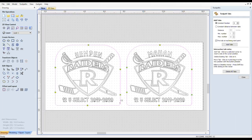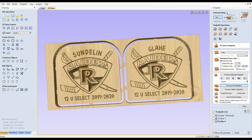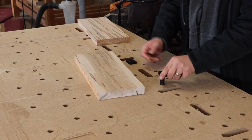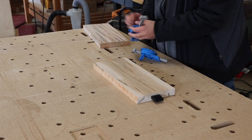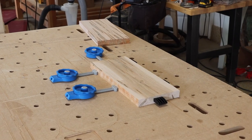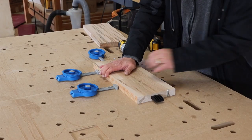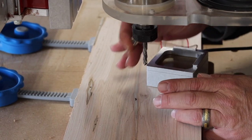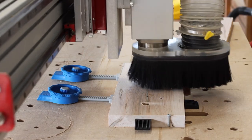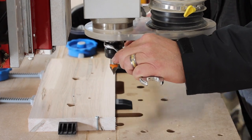The stock is 1.3 inches thick and the wood is fairly heavy and dense, so I wanted some substantial tabs to keep the stock in place while it was being cut. This lumber was S3S — cutoffs from lumber that was planed on both sides and one edge. I'm securing that flat side as well as one of the edges with some horizontal flat clamps, and then I'm going to use some pocket hole screws to hold down both edges. I'm using a quarter-inch four-flute down-cut bit for both the v-carve pocket operation and the profile work. The v-carve pocket operations were very quick, and then we're switching out to the half-inch 60-degree v-bit for the actual v-carve.